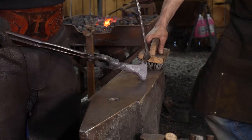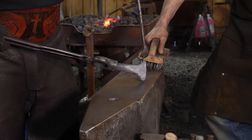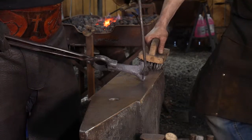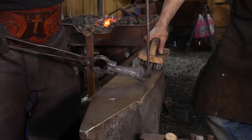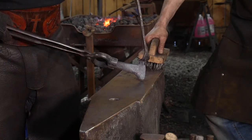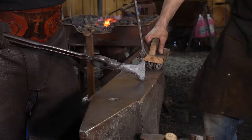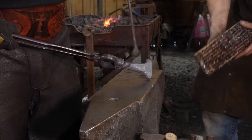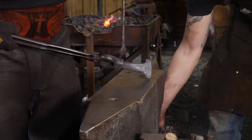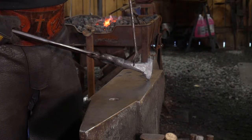We're going to pull the horn out on it. I'm probably just going to do a horn and then a flat, just a regular flat tail section on this one. Make it a single horn versus a double. We're going to pull out a horn on this one side where we've got the most amount of mass and meat. And then on this back side, that'll become the tail of the anvil. And then this portion in here, we are going to upset the mass of this material quite a bit more into this. But we're going to wait to do that